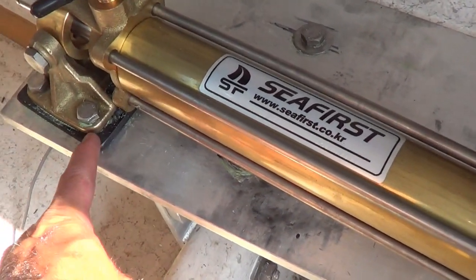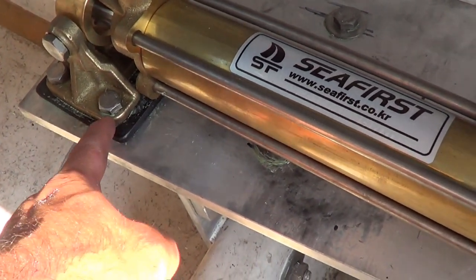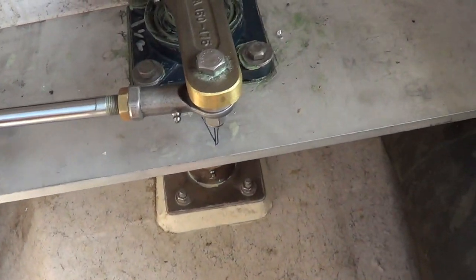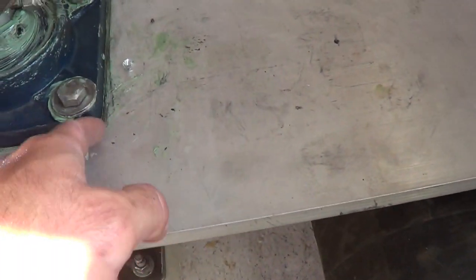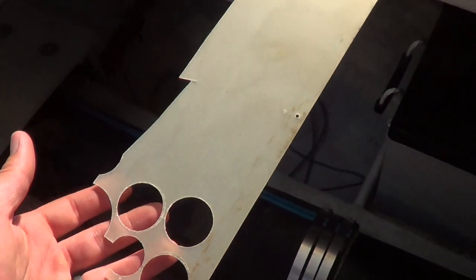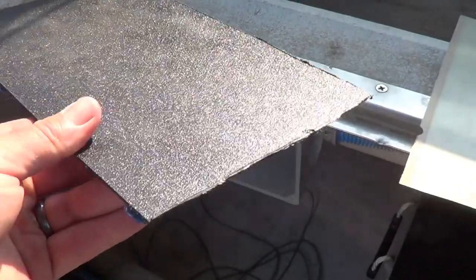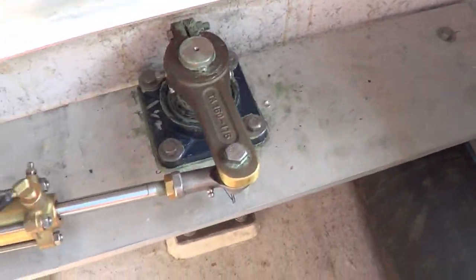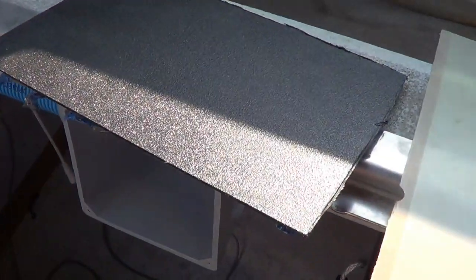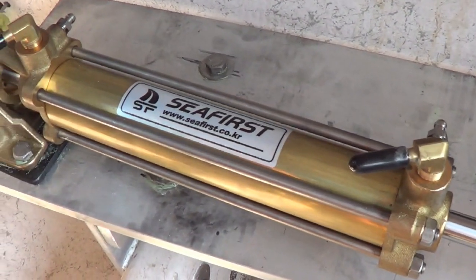And so what we have here is a piece of quarter-inch starboard mounted between the base plate and the steering plate here, the big plate. And then actually in this case, Frank went ahead and put in, it's hard to see here, a little bit of fiberglass sheet that we have. I brought an example of it here, this fiberglass sheeting. And it can be cut to make spacers and shims. And we also have some quarter-inch starboard here. So some sort of non-conductive plastic or fiberglass material between. Tony recommends the starboard because it's great stuff, it's easy to work with, and it's easy to find.